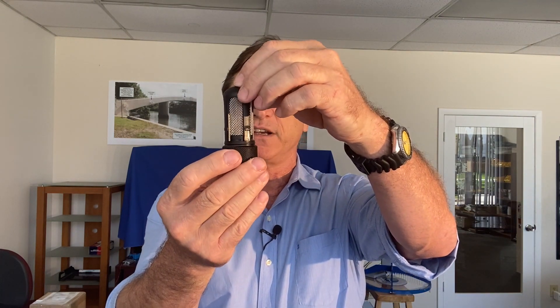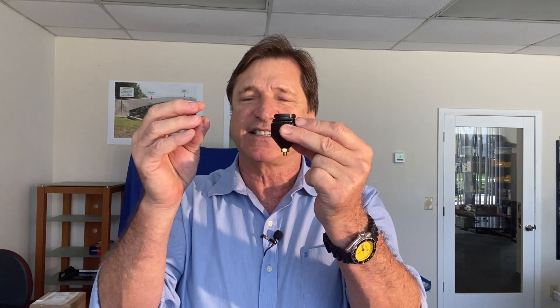This is what the assembly looks like. We just have a stainless steel mesh finger filter which allows small particles through. Attached to it is the flow control mechanism. This flow control mechanism has a reservoir, which is just a hollowed out area inside this Delrin body. Water fills this unit, and then it is automatically drawn down by gravity through the outlet. This happens at a consistent rate, so the water always exits from this flow control mechanism at the same rate.